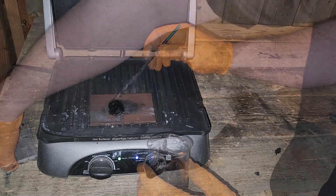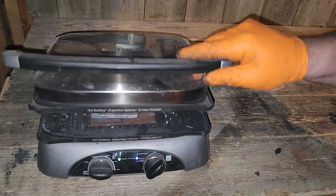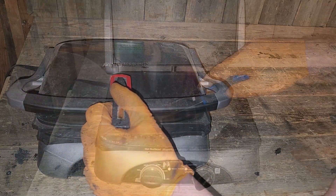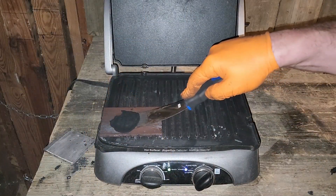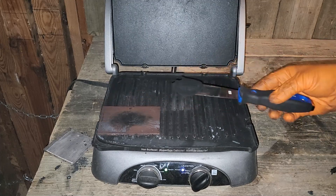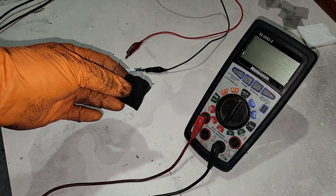I'm going to take my coated mesh and sandwich it in between both these metal plates. Then, with the press closed, I'll use a large C-clamp to apply some constant pressure and let it sit for 15 minutes. At the end of 15 minutes, I'm left with a wonderful piece of solid cathode material. Be careful — it is a little brittle. Here I've trimmed a bit to better fit it into my test cell.